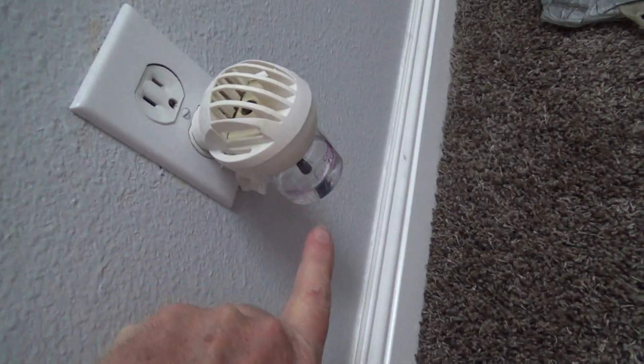There's a little concave area right there where you put your wire and clamp that down. If you're not paying attention and don't clamp it down properly, when you push this into the wall this wire might pop out. What I like to do — the third way — is to wrap it around the screw. I usually strip about an inch long. I take one of these holes, put it on your wire, let it stick out a little bit — about an eighth of an inch, three-sixteenths. Then I turn the wire up and pull out. You'd have yourself a nice little loop like that.